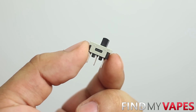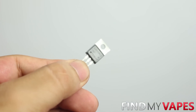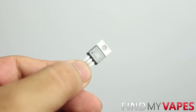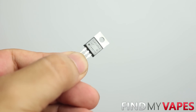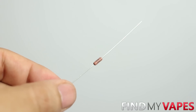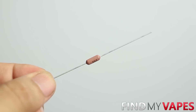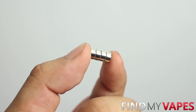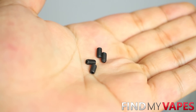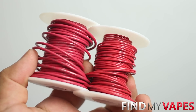With safety in mind, we'll wire in a master on-off switch, put in place so we can turn off the box mod and prevent it from firing. Another safety feature is reverse battery protection — to accomplish that, we're going to wire in a PFET, which prevents damage if you put in your batteries incorrectly. We'll need two resistors: a 20K ohm resistor wired on the OKL chip itself, and a 1.43K ohm resistor wired in line with the potentiometer. To secure the lid, we need quarter inch by eighth inch round magnets and grub screws. For wiring, we'll use both 18 and 24 gauge copper stranded wire.